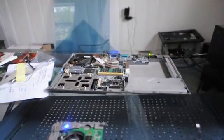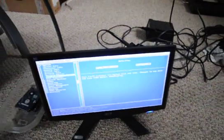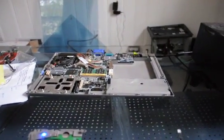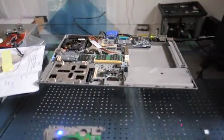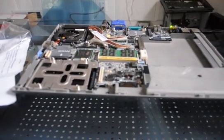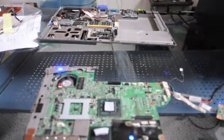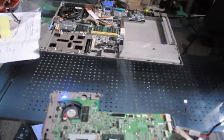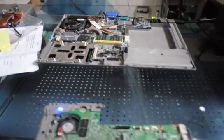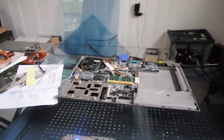So now we've run our Dell board — it's actually a D620 — for approximately three hours, and everything seems to be good on it. What we're going to do is turn it off and put it together. But before we do that, we're going to test a few other things as far as the memory goes. We're going to have to put the hard drive into it and make sure everything checks out — as far as the memory not being bad — and we'll test the VRAM too at the same time. Burn-in seems to have run perfectly fine. Motherboard sounds structurally good and appears to be good, not too terribly hot. So we're going to say the chipsets are actually working and everything's good with it. We'll say this one's done for right now until we put it together and test it out.